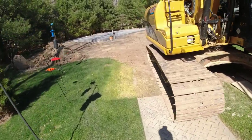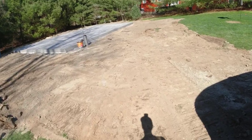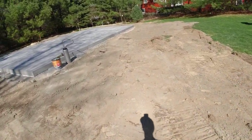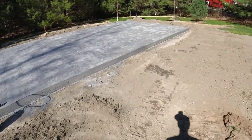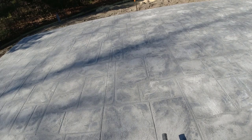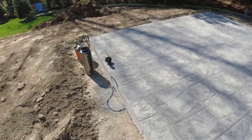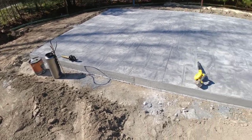So we're back to seal this stamped concrete pad. We got it washed, we got it sawed, it's been drying for a couple of days and it's all ready to go. I'm going to use my little blower to blow it off and then spray three coats of sealer on it. We're using DecoCretes D1 sealer — that's the stamped concrete sealer we like.